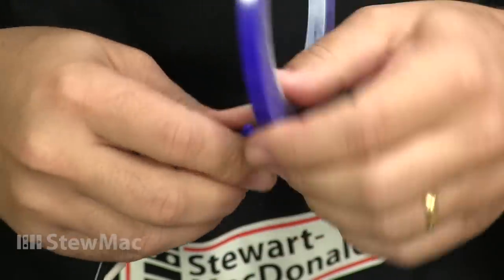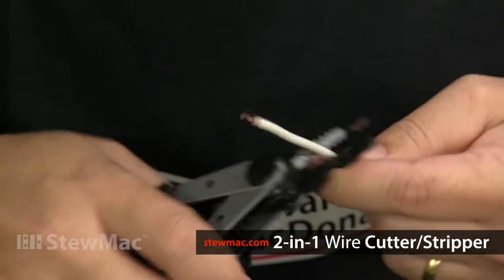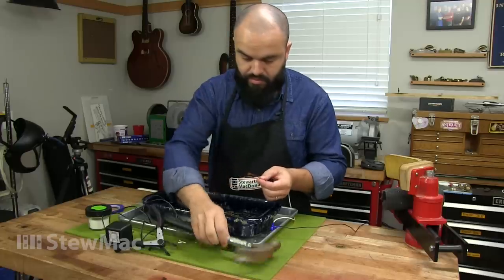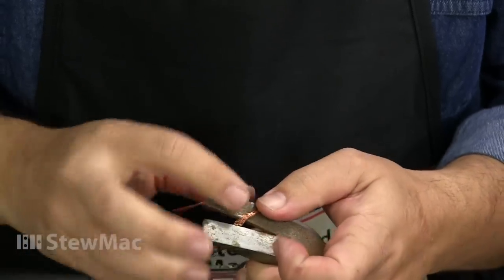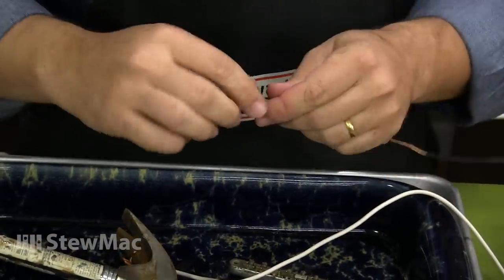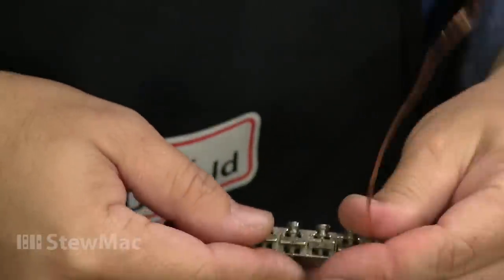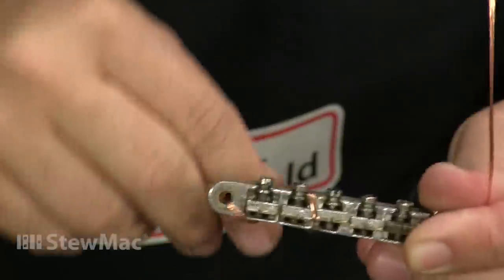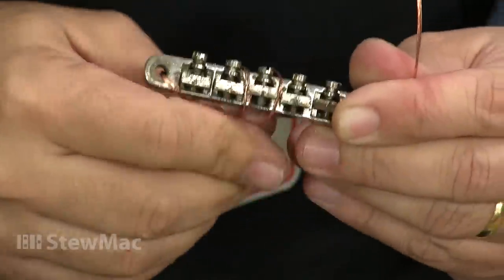At the other end of the positive cable, strip away a longer section of insulation. Wrap that onto your piece of steel, and we're using this hammer for that. On the negative wire, strip a long enough piece to wrap around your part. The more contact you make all around the part, the better this is going to work, getting down into all those screws, threads, and saddles.